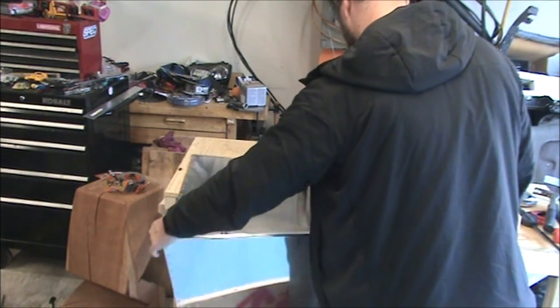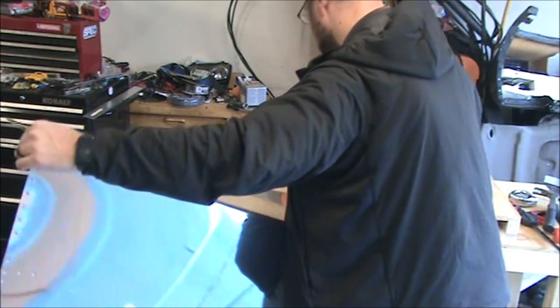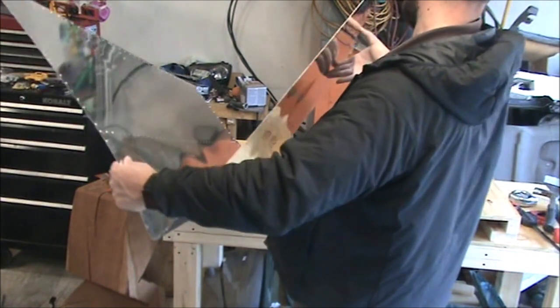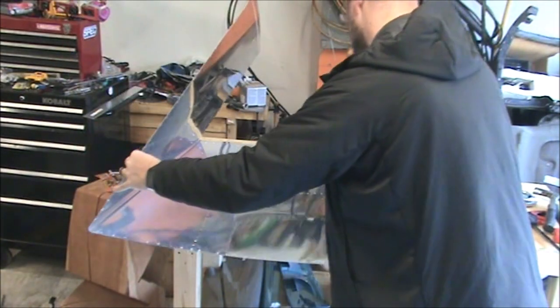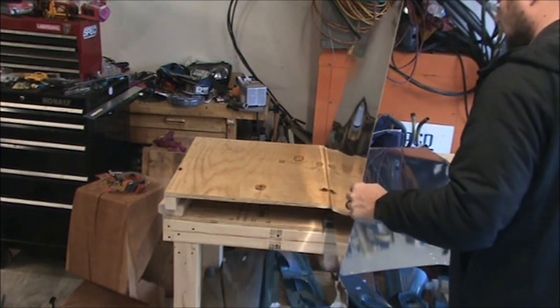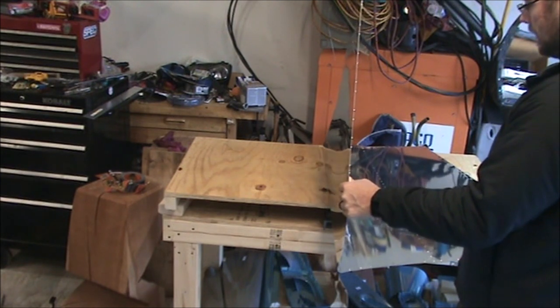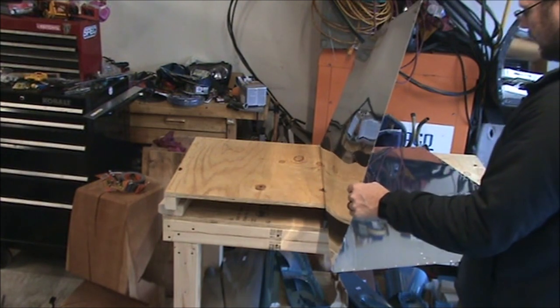But I can reach it in this orientation. So I guess when it comes time to do those four holes in there, I will flip the dies around so that I can dimple with the good surface, or the outside surface of the skin, facing down. And I'll just have to be careful, maybe put some tape around it so I don't scrape the skin up. And other than that, make sure I hit it harder than normal to make sure I get that good dimple first time around.